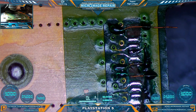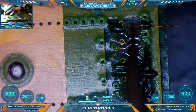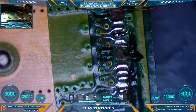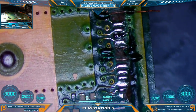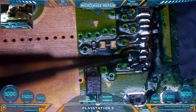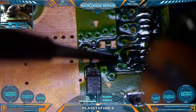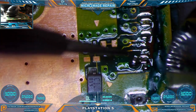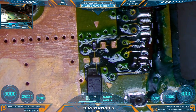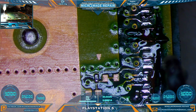Our jumpers should be well cured into place. Go ahead and scrape our jumpers — I could probably just burn off the enamel too, but... I think we'll do one more thing tonight and then push this off until tomorrow; it's getting a little bit late. We're going to go ahead and place our 4k capacitor. Grab a cap — very tiny cap. Drop our air to 20% to fill this guy in. This doesn't have to be perfect. That should work. Tin our jumpers and it should be fairly well prepped for tomorrow.